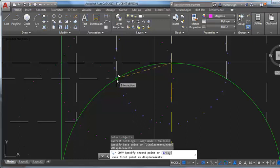So it isn't actually a true measurement. There is a slight error in that, being that I'm using a radius from that point to that point as the space between those two orientation lines. In reality, you can see my little yellow line shows the value I'm going to take down below. But in reality, it's actually the arc that is the part of the header that follows the true circumference. So there's a little bit of error as I do this kind of manipulation, which was always done when layout guys used pencils, compasses, and paper. This just speeds up the process.